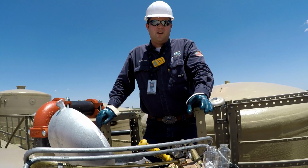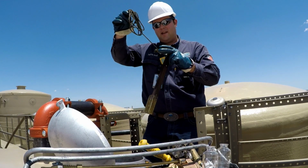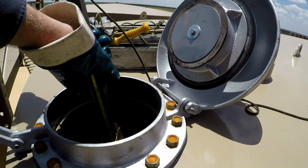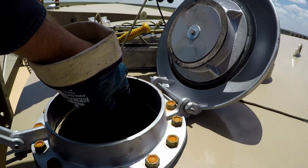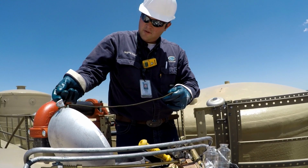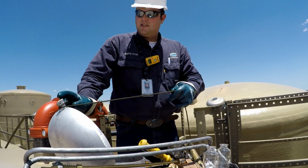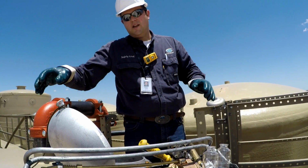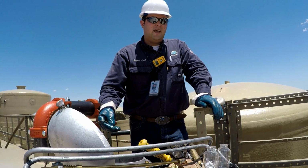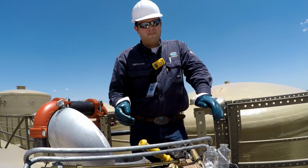The first thing we're going to do is get our wood back, and we're going to drop that into the tank and suspend it to the middle of the oil column. This is going to give us our opening tank temperature. We'll tie that off up on top so that it can suspend and adjust to the temperature. That way, depending on the product gravity, it can take 10 to 15 minutes or more for this to adjust correctly. So it's best to put that in first.